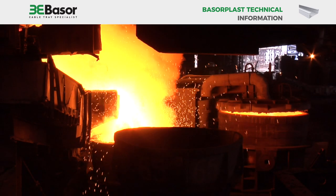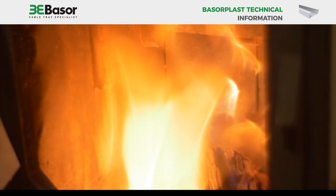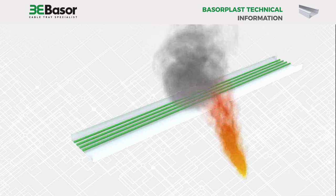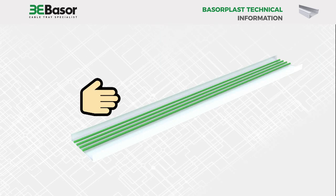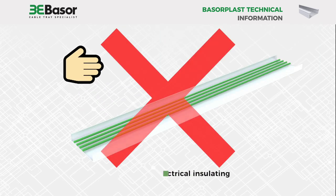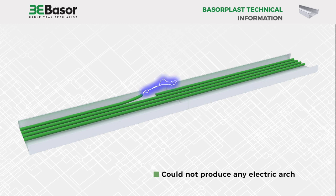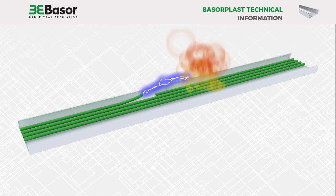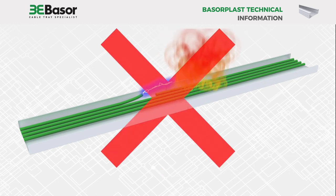In a cable tray installation, without considering external factors, fire ignition can take place due to electrical arcing that can reach some combustible or flammable material near the tray and become a dangerous, life-threatening fire. PVC cable trays are electrically insulating and thus could not produce any electric arcing if cables are damaged. So, related to fire, the intrinsic property of the material prevents fire ignition, which is the most important characteristic.